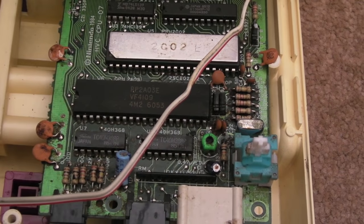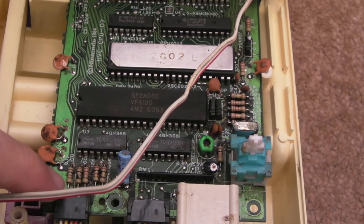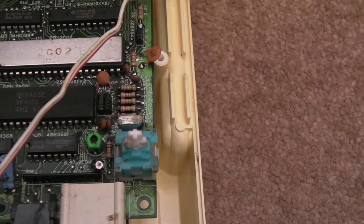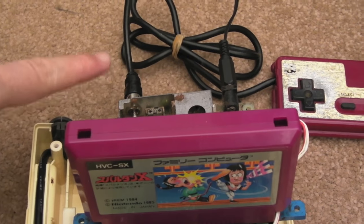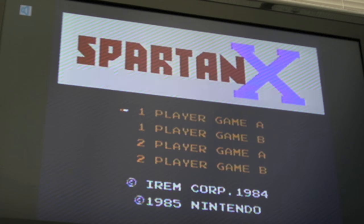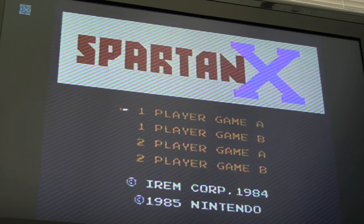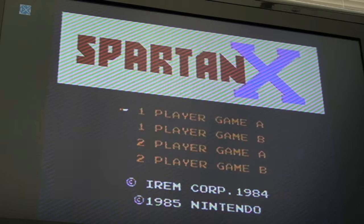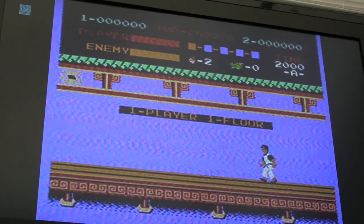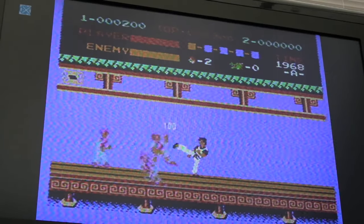After a really brief clean up of the board, you can see it's still really dirty, but I managed to get all the dirt out from between the contacts. There's still a fair bit of dirt around the crystal and some components, but I've got power connected and the RF lead. Bearing in mind, as I said in the previous video, it's NTSC-J, so the audio is on a different carrier frequency — I'm not going to get audio. But as you can see, that's working. I can try to start it — let me just reconnect the power again, the power connections aren't making a brilliant fit, but it starts, you can see that works.